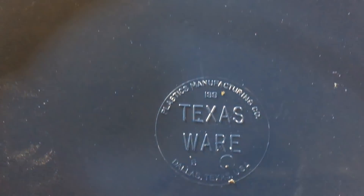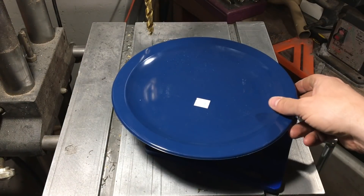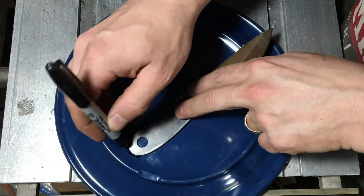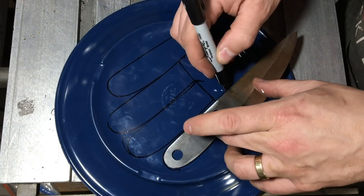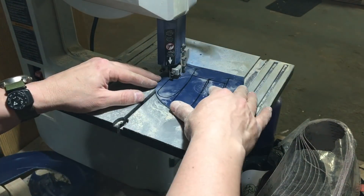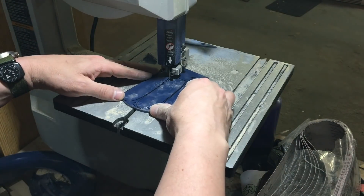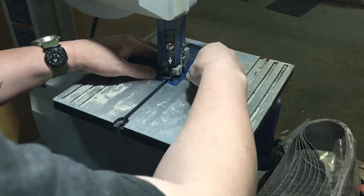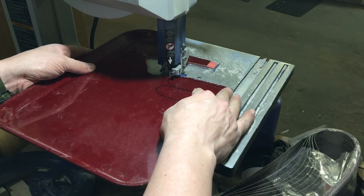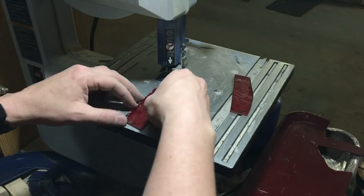With those drilled, this is the material I picked up for handle scales — it's a plate, a kind of weird ceramic plastic material. I like the copper coating I had on the knife, and I wanted to find a material that I could maybe refresh and keep the handle copper-plated, so I wanted to choose something plastic that would do well with the acid in copper plating. I cut out the different pieces — I wanted to have four pieces of this plate as part of the handle. I also have a tray that I used in a previous video for my cashmere micarta S-wing hatchet. I wanted to have kind of alternating blue, red, blue on each side of the handle.